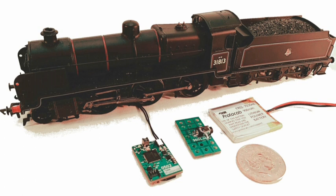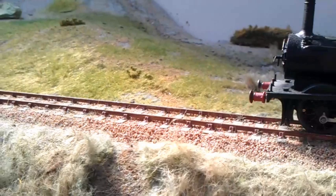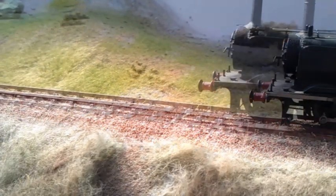Let's have a look at some very simple characteristics of the direct current motor. If a DC motor with power applied to it is not free to rotate, it is said to be stalled. This may seem like a remote possibility, but this is exactly the situation the motor is in just at the point where, having been stopped, it is about to turn.